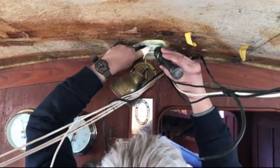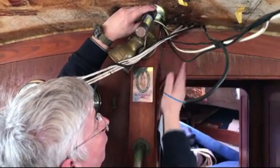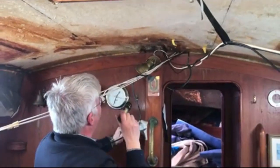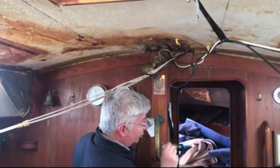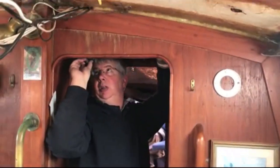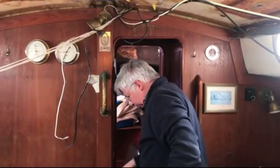The mast step bolt goes through and there's a nut there — how on earth are you going to do anything with that nut and get your mast step off with the compression post in the way? It's completely illogical. Looking at the bulkhead, it's not actually properly attached to the inside of the coach roof because it's moving, so it's not really supporting the mast very well. Where it's attached is not properly attached. I'm going to look in the bilge now to look at the mast compression post.